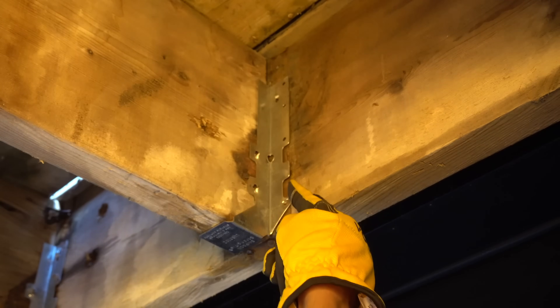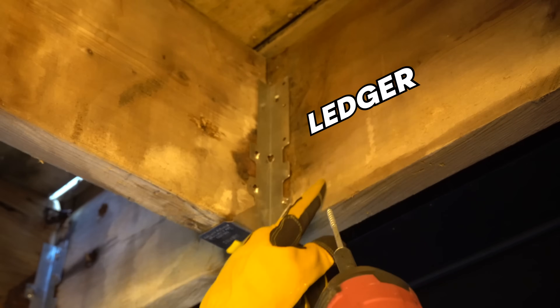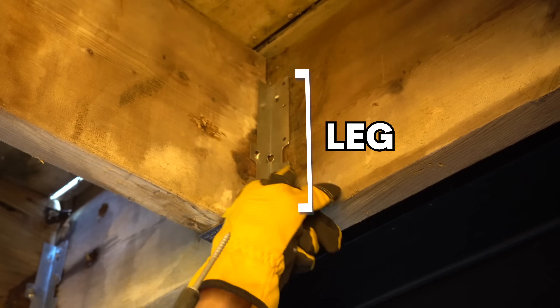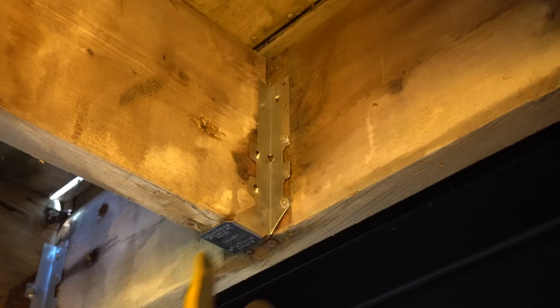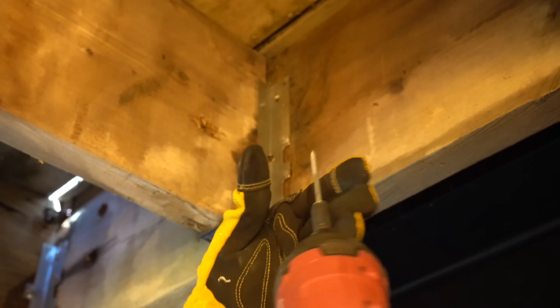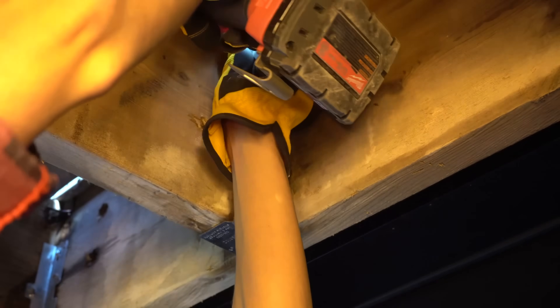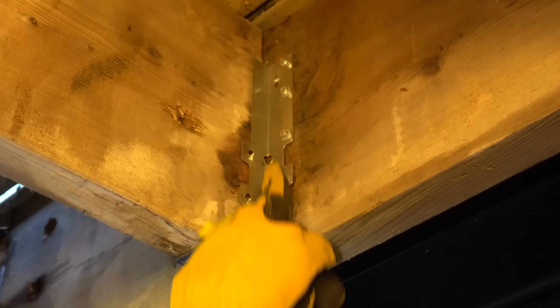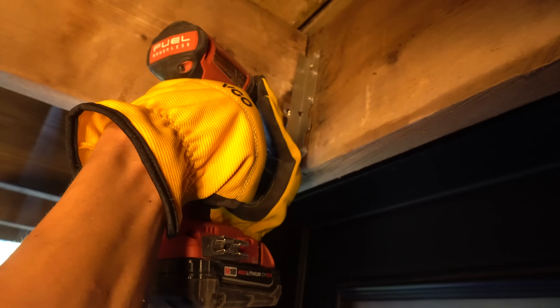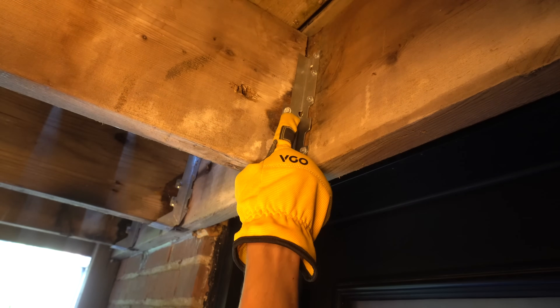Once you have it there, I always start on the right-hand side because I'm right-handed. It's a hex head — put it on your driver. This is the ledger side; if you have a floating deck, it's a rim joist. I'm going to go into my ledger on this side of the leg. What you need to know is that with joist hangers, every hole needs to have a fastener, whether you're using nails or screws. Put one in on the other side and continue on filling all the holes. Now here are the 45-degree or diagonal screws — you still need your longer screws here. They go in at a 45; they make it super simple. That's squeezing in nice and tight.